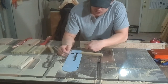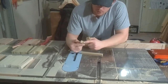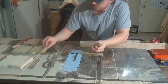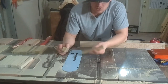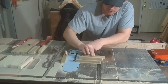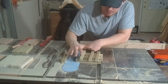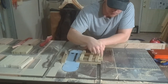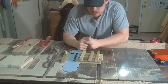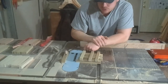The widest I've gone with this insert is half inch, so just chucked up half inch again. My squared thickness of my stock is 11 sixteenths of an inch, so I'm going to make a lot of dados and they're going to be slightly less than half the thickness of the material. That way, once I have my three pieces and then the three pieces on top, they're not going to be perfectly flat — there'll be just a slight bit of a difference. Once I'm done with that, I'm going to put a 30 degree chamfer on everything.